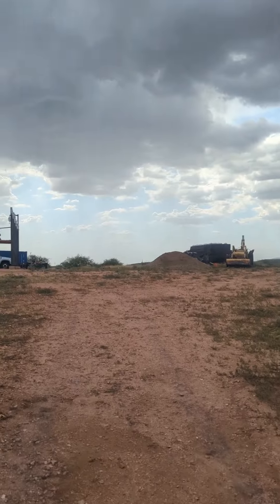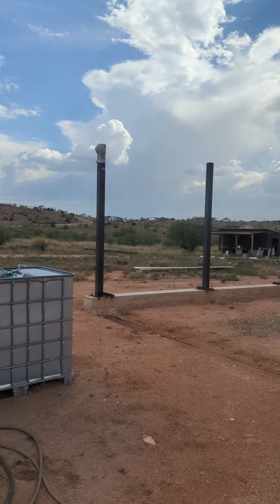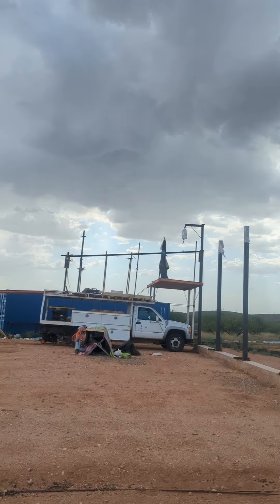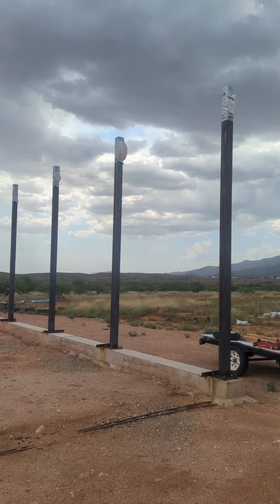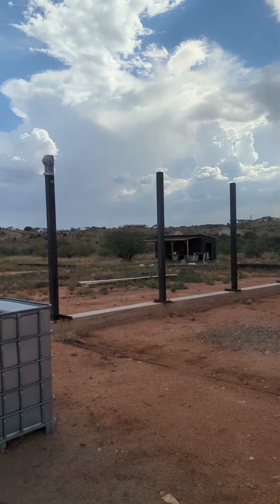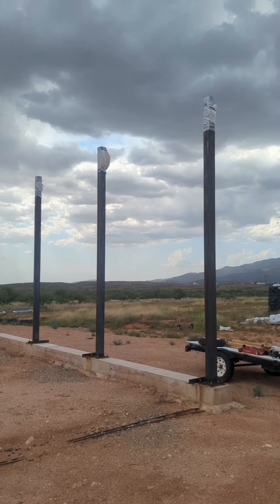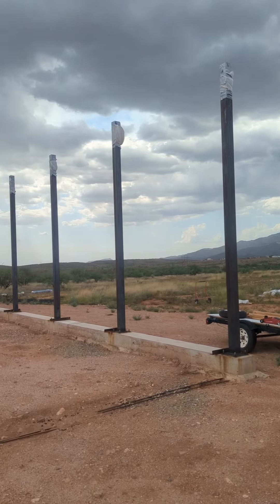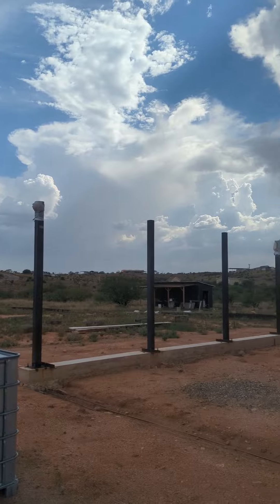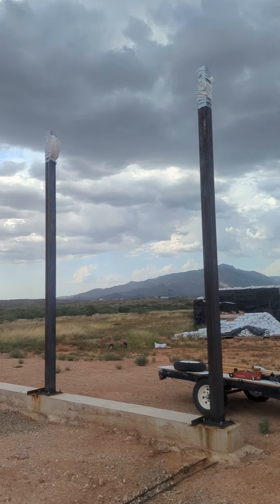So if you're new to the channel, this is a 2,000 square foot barndominium that I'm building mostly solo. I started this thing over a year ago and just been plucking away at it. When you're working by yourself things move very slow. I've got two sides of the stem wall done, I've got my posts here — under each post there's four feet of concrete with a bunch of rebar. The rebar ties the wall together. These poles are five inch by five inch by a quarter inch thick, so they're pretty thick, nice stout posts.